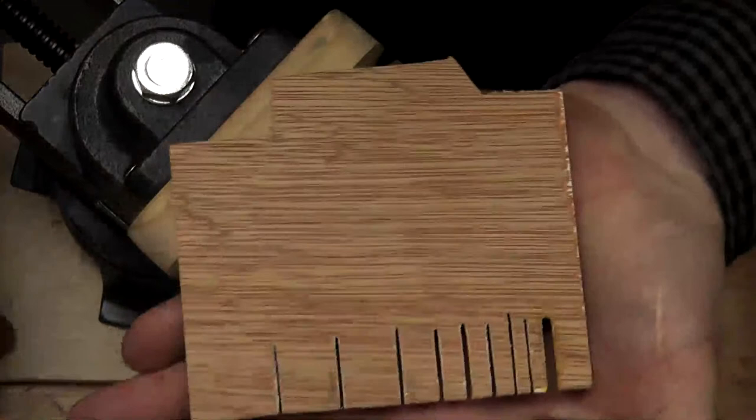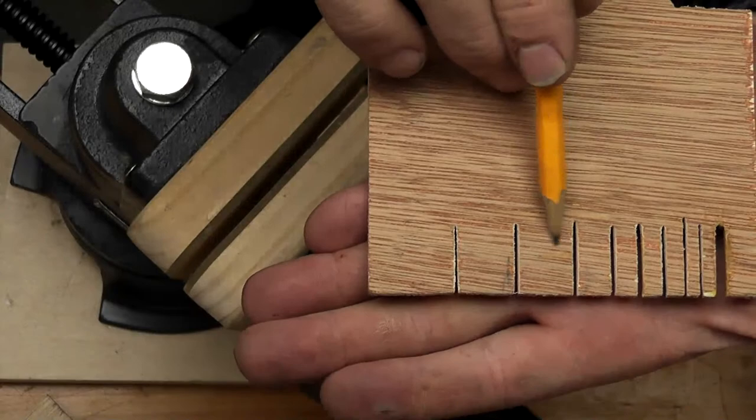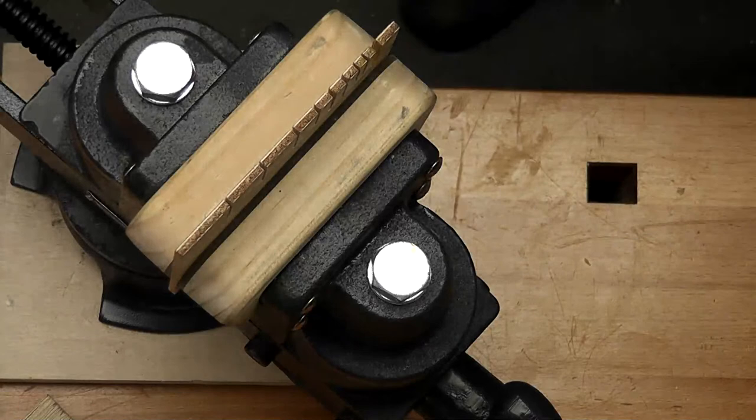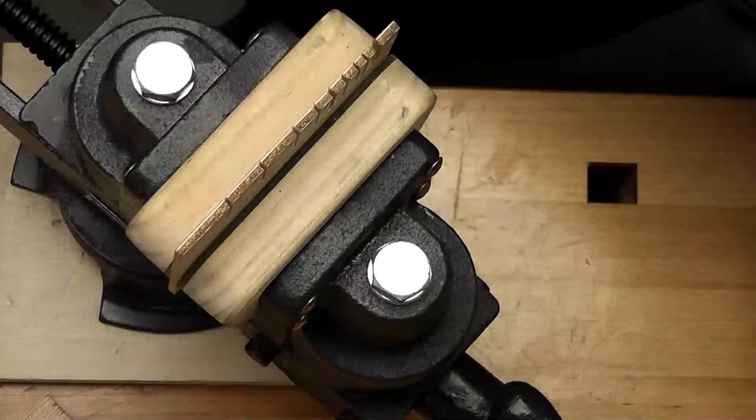The plywood template — very similar. The spacing starts off like five mil apart, then ten mil, fifteen, twenty — so it gradually increases. Tighter at the top, that slot at the bottom is bigger — that's important. When I cut these I did them with a Japanese hand saw, nice and fine, I don't want too big a slot. I've then got a bit of a file and I've rounded the edges, taken the corners off, because I don't want it breaking the fibres. Just to soften them.